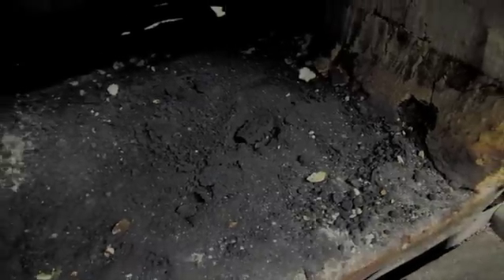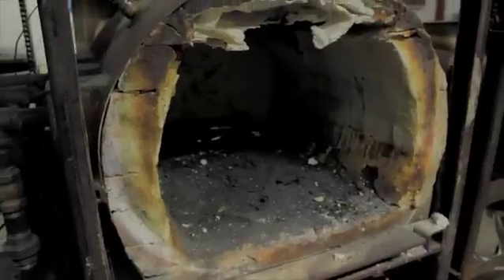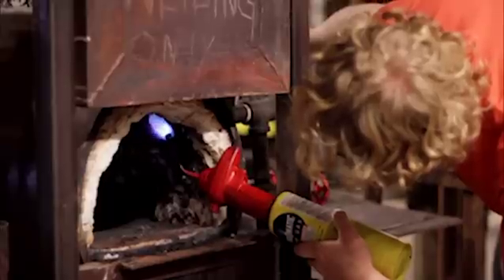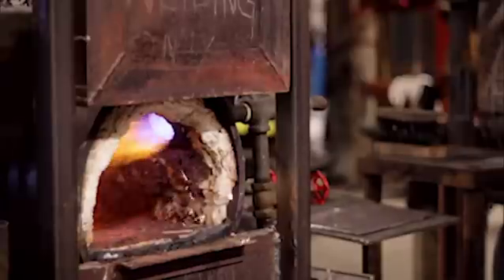This is the forge. It's the oven that cooks the metal to over 2000 degrees Fahrenheit and breaks down the crystal structure of the steel. The basic structure consists of a cast iron pipe with holes punched into it. This allows for natural gas and air to pass through, which ignite the intense flames from within. As the flames shoot out of the holes, they bounce against and around the interior walls like a vortex, which minimalizes heat loss.